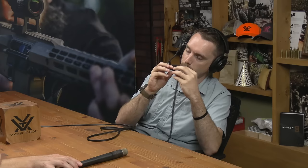When this begins to erode and material is literally being torn away, burnished away, or burned or jetted away, that throat will begin to extend. That lead will get further away, and that lead will be less geometrically perfect. That's what people call throat erosion. And that whole part of the chamber forward of the cartridge case itself, where the projectile is stationary and then transitioning into the lands and grooves, starts to rip away, for lack of a better adjective to describe what's actually happening.